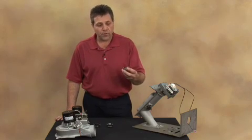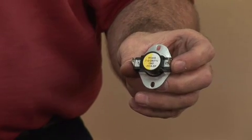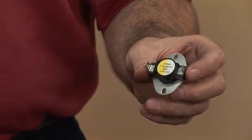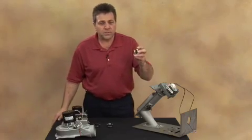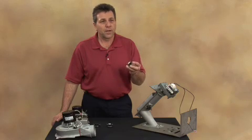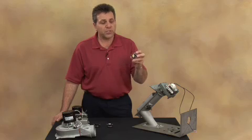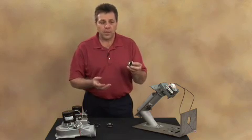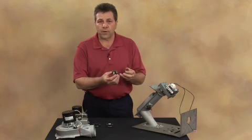This one here is typically yellow in color, and sometimes divided between yellow and white. This is the normally open fan sensor, low limit sensor, and proof of fire sensor. This switch is normally in an open position, and when the unit heats up it will close, complete the circuit, and then the unit will operate.